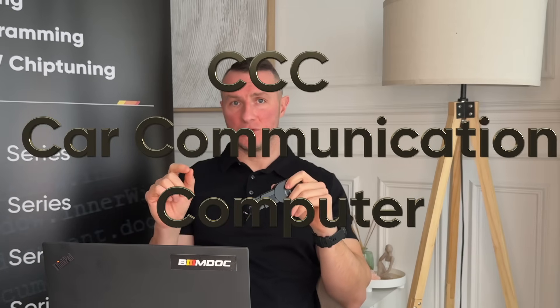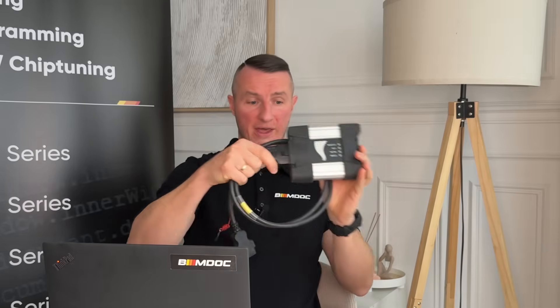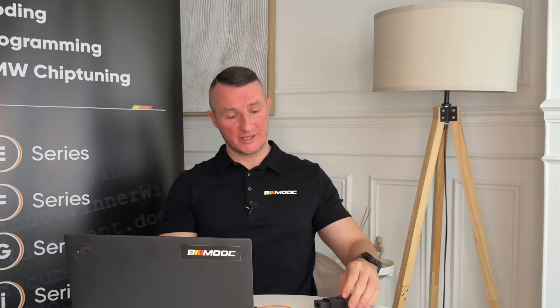My subscriber tried to update the head unit of a BMW. It had a CCC head unit — Car Communication Computer — which actually consists of five different modules inside one, as you can see in the picture. In order to program those, you have to program them in a specific sequence. Some are programmed just over the ICOM, and some require a fiber optics connection because the bandwidth is too great without it. He connected everything as it should be done by the factory — no errors on his side — started programming the head unit, and it failed.